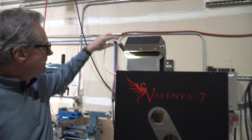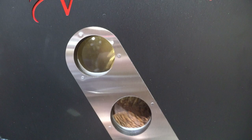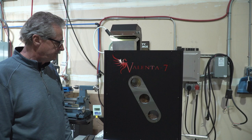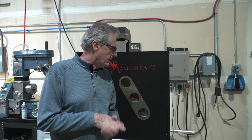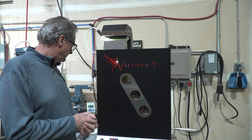We have a light on the top of the hood — just a magnetic light that goes on the side and shines down inside, so you can see the beans. If you have good light in your room, you'll notice you can easily see the beans going by and what the color profile is looking like. When we go to dump, we open the blast gate over there, get the cooling air drafting down before we put the beans in, and then you're ready to go.